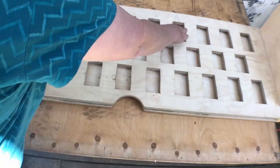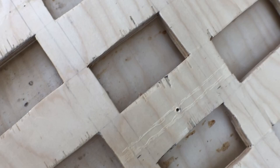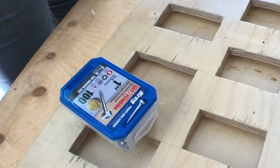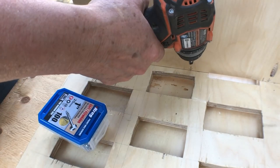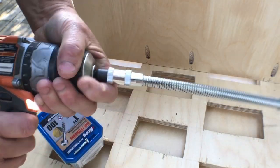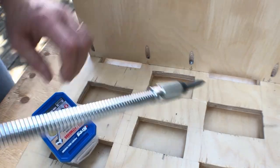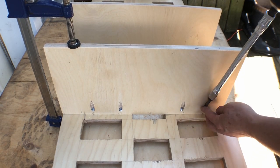Okay, it's time to assemble the legs. I have all my pieces cut and glued up and I'm ready to go. Whoops — the other way. I guess I did glue them the first time, but since the screws didn't cinch down tight the glue didn't hold well — that's why it was so easy to get the old ones off. I'll clean this up a bit with a chisel so the old glue doesn't get in the way. This time I'm going to use actual pocket hole screws, though I kind of resent having to buy special screws that were hard to find and seem to only come in boxes of a hundred. I would need one of those four inch driver bits, which I don't have, but I do have my flexible extension, which will do the trick. Well, that works much better with the real pocket screws — I can really feel it pulling the two pieces together snugly. I guess there is something to say for using the recommended screws. I'll have to think of other uses for them now that I have a box of a hundred.